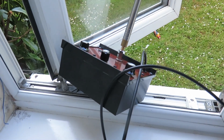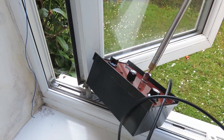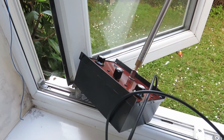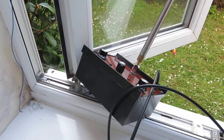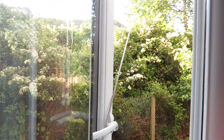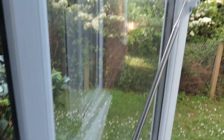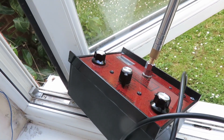Being on the ground floor, my results won't be as good as someone on the third or fourth floor. If I were up there, the loop antenna alone would probably be all I'd need, because I'd already have the height. But since I'm lacking height, the MFJ-1621 with the extended whip gives me some additional height and therefore better results — maybe a few more QSOs than with the loop antenna alone. These are the two antennas I'd recommend for flat or apartment dwellers with restricted antenna installations.